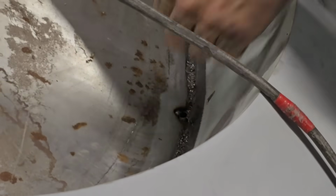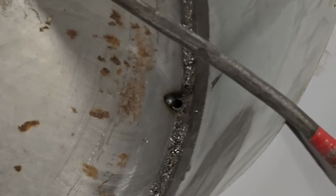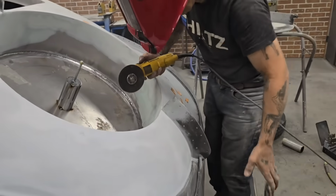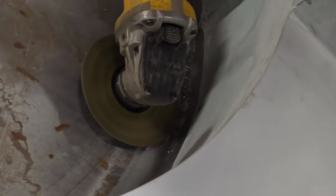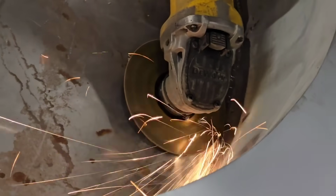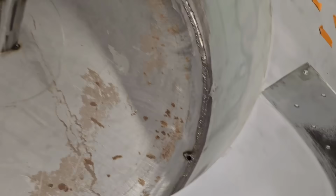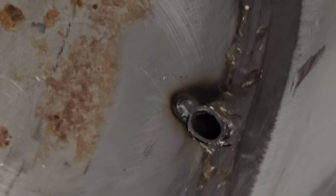Good. Now, what other? Watch yourself for a second. Here's what we want, or I want. I'm going to take Colton's air hose, so I'm going to blow on it as soon as I weld it. I don't want to warp the pan up. That's easy to do.